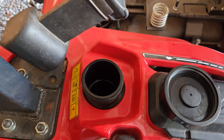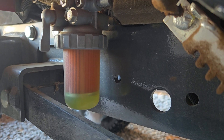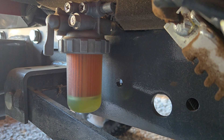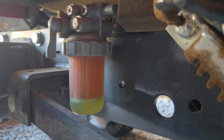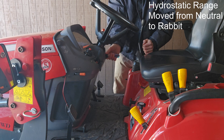So that looks pretty good. And then I'll check out the fuel filter — just take a look and see if that looks cloudy, which it doesn't. So my fuel is not clouded or completely gelled. That's my general procedure for checking out the tractor. Let me switch here real quick and just show you that the brake isn't required in order for the tractor to start.